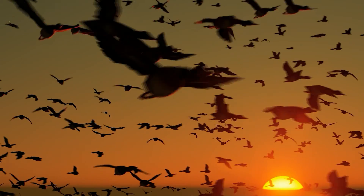Number nine: although shading is not an issue with the location of my solar system, bird droppings definitely are. If a bird targets my array and I can't get it cleaned immediately, it only affects the panels that got hit — it does not affect the entire series. Without optimizers on a string inverter, that would be a problem.